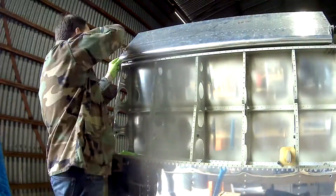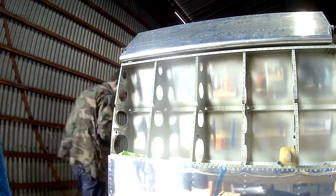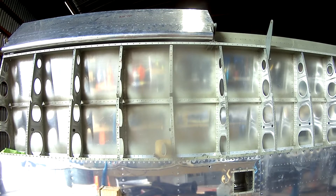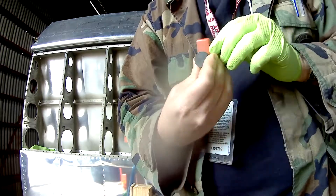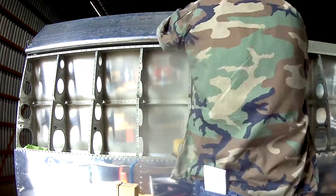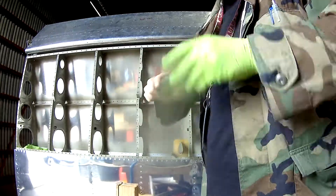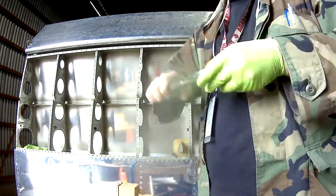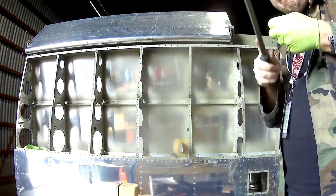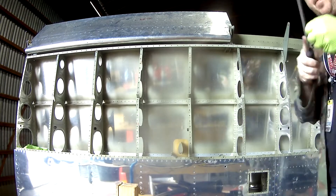There are very specific AN bolts with washers and some spacers. One thing is that this wing has had the service bulletin applied — Van's came out with a service bulletin for the inboard aileron hinge bracket. One of the problems with that is that with the new, very thick bracket in place, you have dome head rivets which get in the way of the aileron. What some people do is simply shift the spacer and add another washer as a spacer, shifting the aileron over about sixty-five thousandths of an inch to clear everything. That's what I did here.